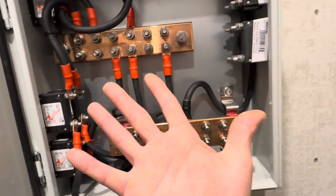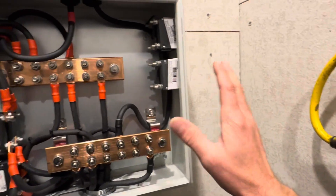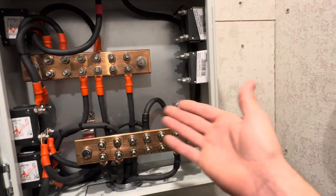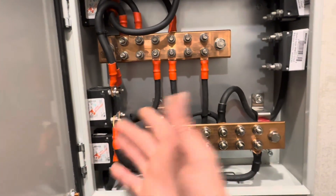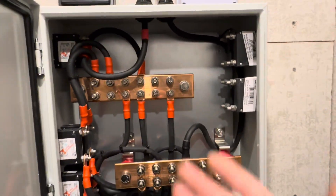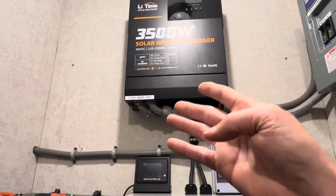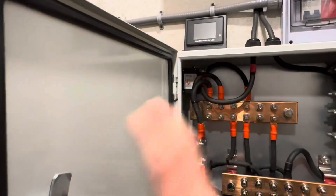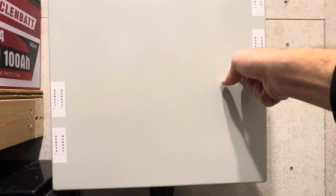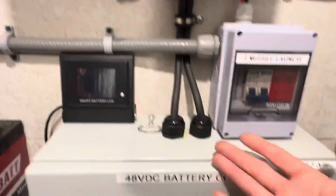I'm currently using four breakers with five sets of batteries. The Vader battery is sitting over there with its own breaker, tying in straight to the bus bar. The other batteries don't have their own OCPD, so they rely on the breakers here. I've got room for four more banks, so maybe eventually I can get from 555 amp hours closer to a thousand amp hours. This is an outdoor-rated enclosure with gasketed seals, but I'm using it indoors. The latch and key are great if you've got children or anyone you don't want accessing the battery compartment — it even comes with a spare key.